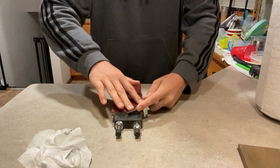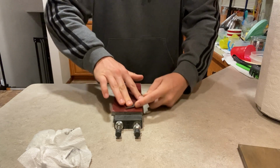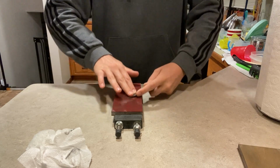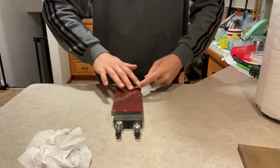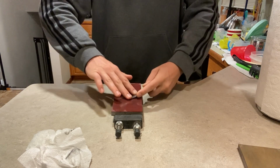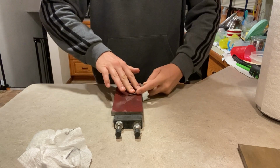And just as a reminder, that 240F is like a 330 grit in terms of maybe a DMT coarse, similar to that. Tends to be a lot more even of a finish than the DMT does. If you want to watch my coarse diamond video, it's 400F is like a DMT fine-ish, 800 grit or so. I forget the micron ratings, but they've got a range. These Venevs are way more consistent in their scratch patterns than diamond plates are, but still not as consistent as something like the Naniwa diamond stones or the super vitrified.